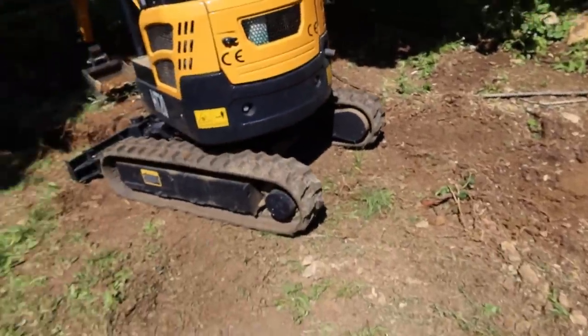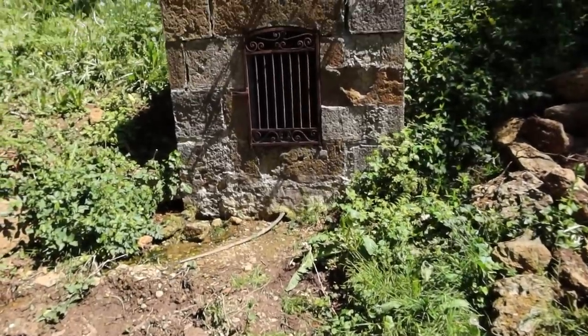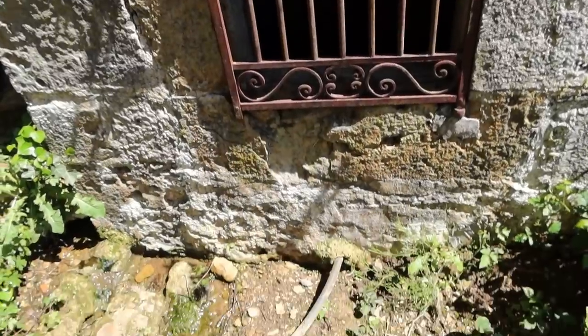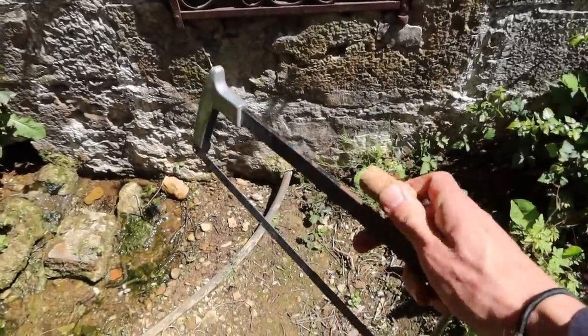I've made a little bit of progress. I've decided a good idea now is to swap ends and start at the water source, digging out that end. Because if I carry on here, I'm going to leave the digger at a very funny angle for the last critical digging bit. Down here is the previous owner's water supply for the pond, which we're getting rid of anyway — it's sticking out of the way, so I've got to cut it and block it up with a cork.